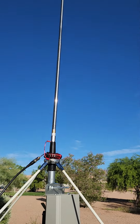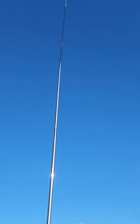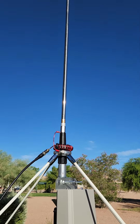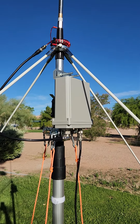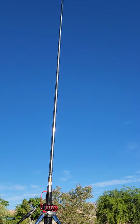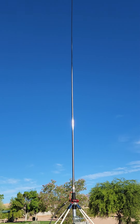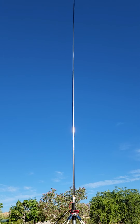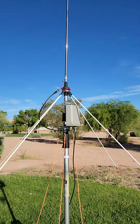Above that we've got an 18-foot whip that goes all the way up to the very top. The idea is we can drive this tuner from the radio and make it tune up this whip so that it thinks it is an integer number of half waves on the antenna — it'll electrically lengthen or shorten it.